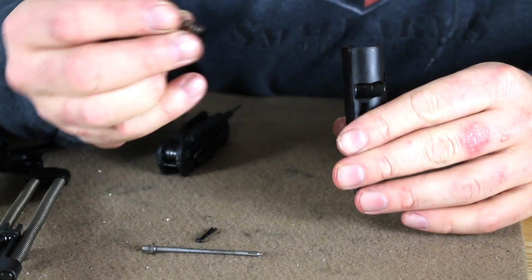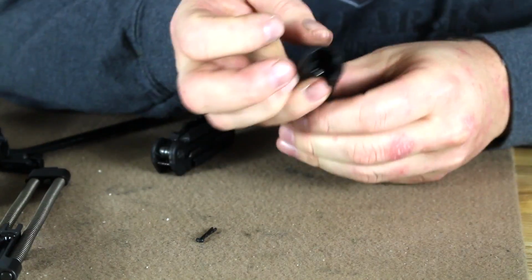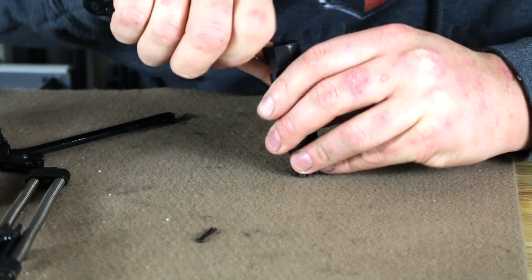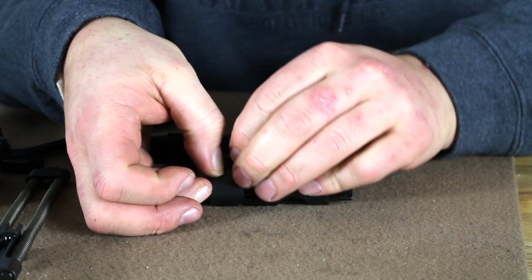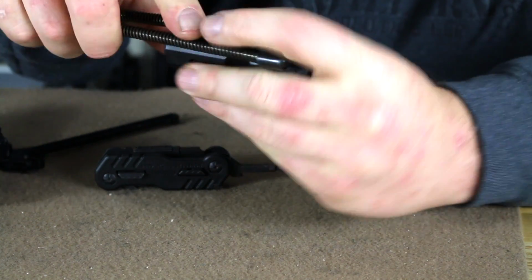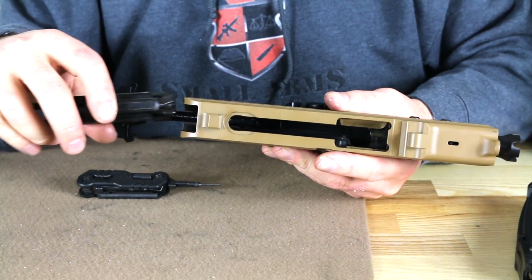As previously stated, you make sure you have the spring in place. Depressing the firing pin. Insert your firing pin retaining pin. Then we're just going to slide over the dog leg and drop that into place in the notch. And there we have it. So for reassembly, drop the charging handle in. Make sure it's in the unlock position, which it will be because of the spring.